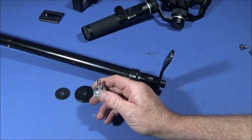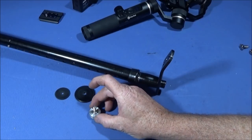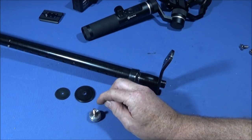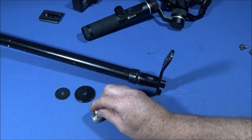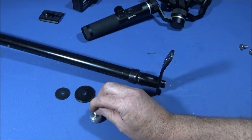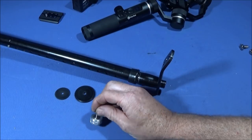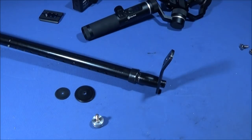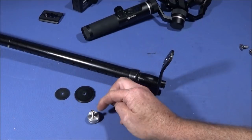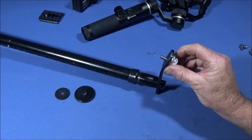And Loctite 638 will go off in a few seconds. If it's cold weather, just use a gas torch just to warm it slightly. And it's rock solid. And it's a high strength adhesive, so that screw won't come out of there again unless you wanted it to. If you wanted it to, you would have to heat this up so that you saw some vapor coming off, and then you could actually pull that screw out. So that's the way to actually break Loctite 638. But apart from that, this screw will stay in there and it'll be nice and strong. And that saves so much time in the workshop when you do things like that, rather than thread cutting and making the whole assembly. So that one goes in the underside there.